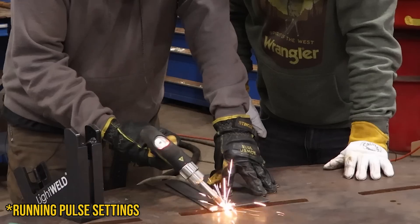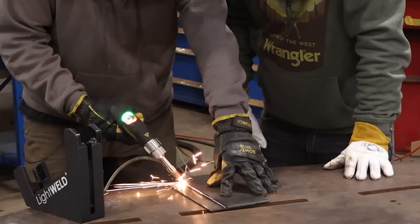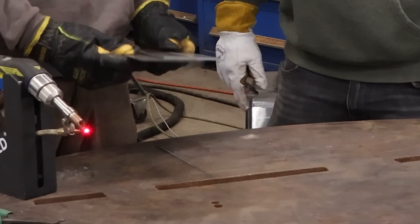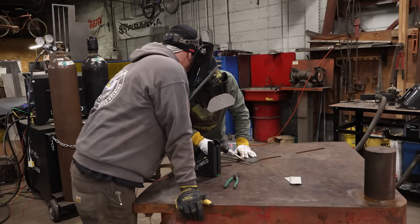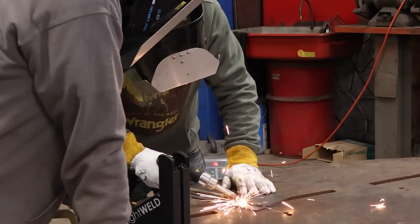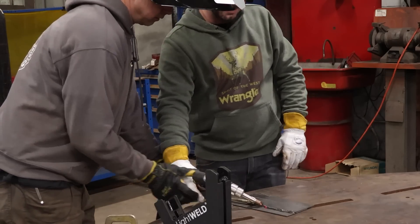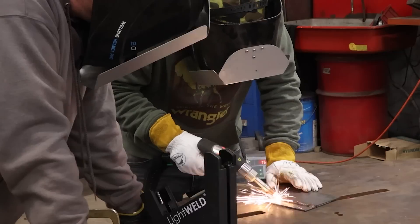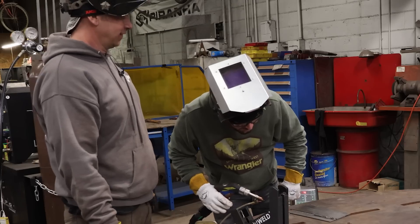Okay, is everybody covered? Yes sir. [Welding demo] There we go — so this particular weld at 1000 watts has so much penetration it's welding through to the table. That's crazy! Is it super hot? It's not super hot. [Second attempt] That doesn't look like it's doing it — check your angle. You have to have the angle parallel to the plate, then go ahead and continue welding from there.